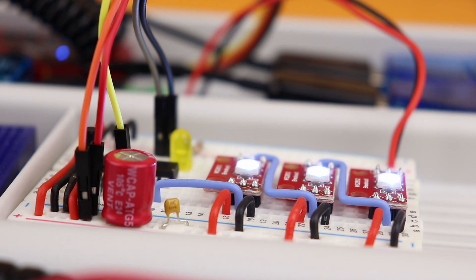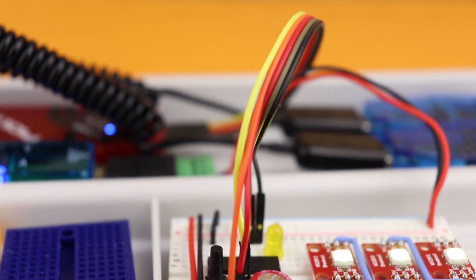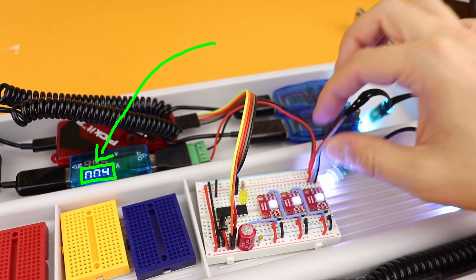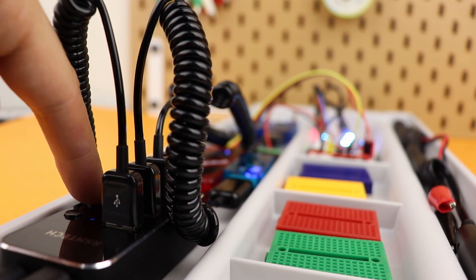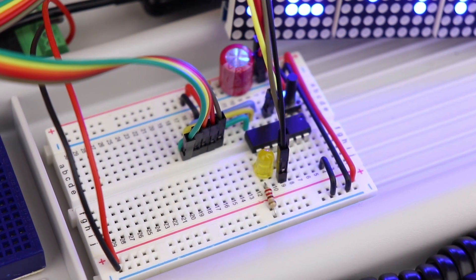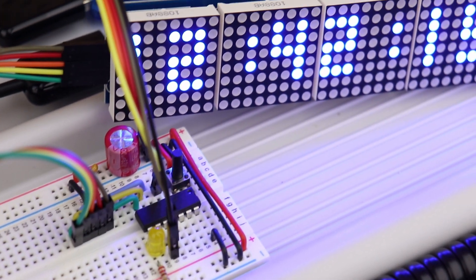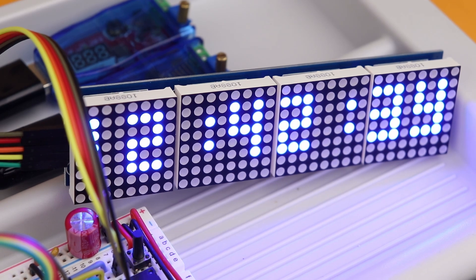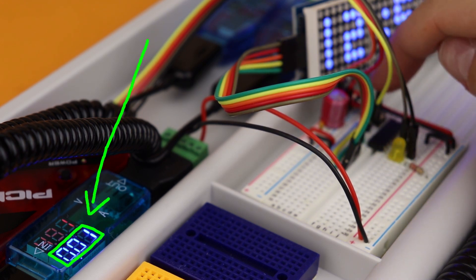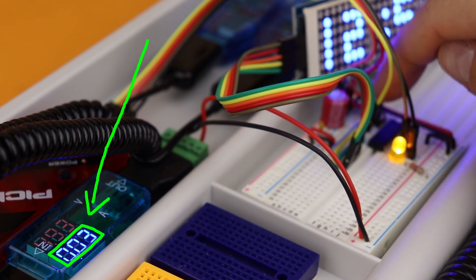I also want to really show you that this works and you can totally build the projects on this channel with this tray lab. Here is an example where we drive the WS2812 NeoPixel LEDs from within our tray lab — we can program the microcontroller with the included PICkit 3, and if we add more LEDs to the circuit the total current consumption goes up as expected. We can also turn the entire circuit on and off with the press of a single button. As another example, this is the circuit from the MAX7219 LED multiplexing tutorial — it uses an 8x32 LED dot matrix display, and as you can see the dot matrix display really consumes some power. If we change the LED brightness level with the push button, we can look at our ampere meter to see that the current really decreases to smaller values.